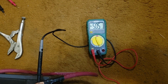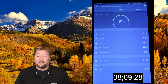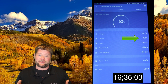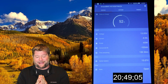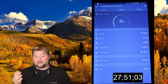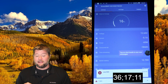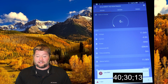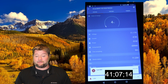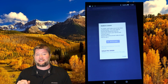We're going to start the test here and you can see everything's going to be counting down. The Victron says we're drawing about 4.9 amps, and the voltmeter said 5.06 — as close to 5 amps as I could get. As this runs, you're going to notice that we get up to about 41.3 hours according to my timer and even just by looking at the clock at the top of the Fire Tablet — that's 41 hours and 18 minutes. Then the error code hit, the lights went out — that's how long they lasted.